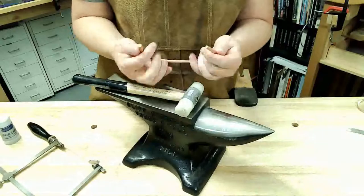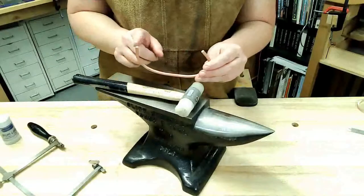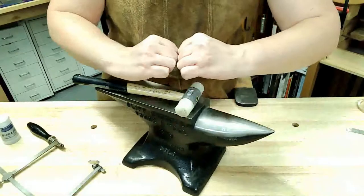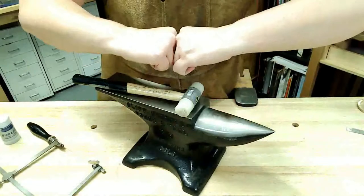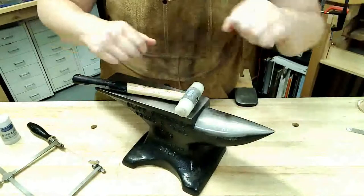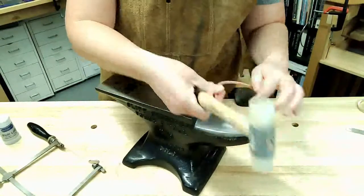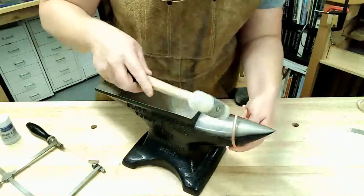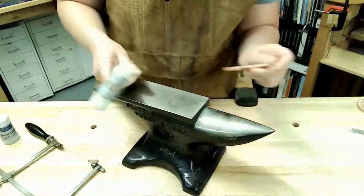What I'm going for here is not making this fully round. What I'm worried about is that when these ends come together, they come together flush. I don't want a valley in between — I want the ends to come together so that I have a lot of surface area for soldering and a nice clean seam. Right now I'm worried about bringing the ends together flush for soldering.